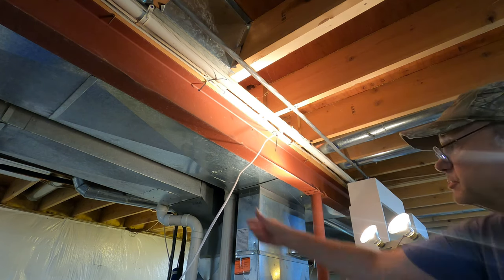Let's look at the coil connections first. We can see that the 120 volt AC control signal goes across the entire length of the coil, from the white black hot wire to the white yellow common wire. We can also see that even as I'm not using the 24 volt white blue connection, if that conductor were to touch ground or some random exposed electrical contact or a person, the results could be very bad. Because there's current flowing from the hot side through the entire length of the coil and through here.